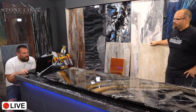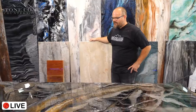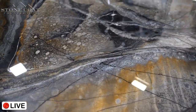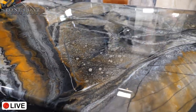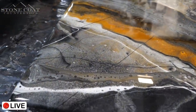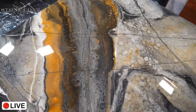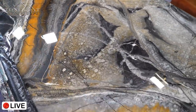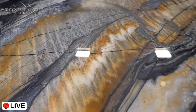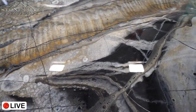What about a curing time for the platinum? It depends on your environmental conditions, but it's so fast. I hate over-embellishing. I'm seeing a lot of that online, where it's ready to use and fully cured in 30 days. Well, the reason we tell people that is because all resin is going to harden and harden more as time goes. The danger is if resin becomes too brittle and there's any sort of movement in the substrate. That's why resin used to not be a good product over wood: it became too brittle, and as the wood expands and contracts, it fractures. And so our formulas are designed to go over laminate that will flex.